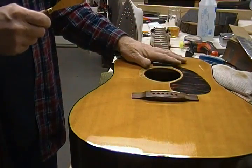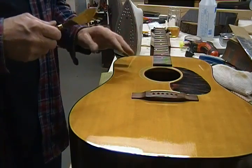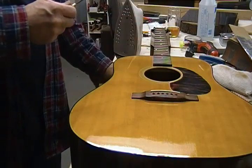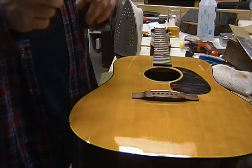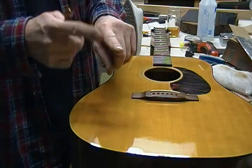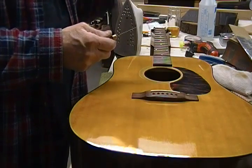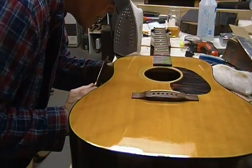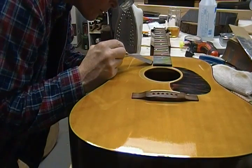The first couple resets I did were actually on really inexpensive guitars. They put them all together and then put about an eighth of an inch of urethane on them, probably of some sort. So you have to go in and cut down with the razor knife and basically cut that — it's like a fillet weld in the corner where the two pieces come together, it's just puddled in. But now on this guitar — the 1950 Martin that I pulled the neck off of — you don't have that. There's no puddling whatsoever here between the neck and the top.